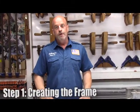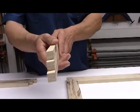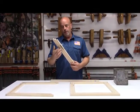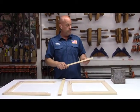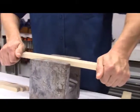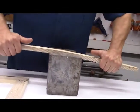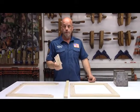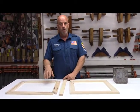All right, the first step to do this process is to mill your stock up. Now I'm gonna have a 2.25 frame going all the way around the door, which is gonna be a place to put the European hinges in and also give me the stoppers on the other side. This makes for a very, very solid board that's impossible to bend, compared to one that has a lot of flex in that piece. They're similar in size. So this is 100% more rigid than just laying a piece of plywood in there. Now, of course, we're gonna get honeycomb inside here, but we're gonna go over that in a bit.